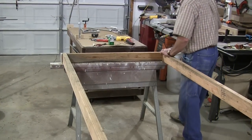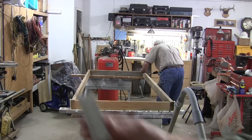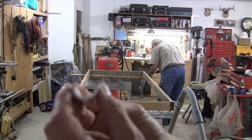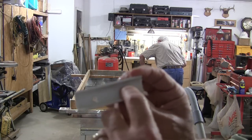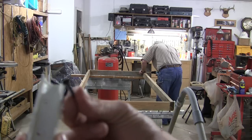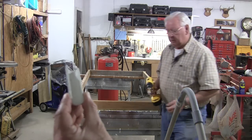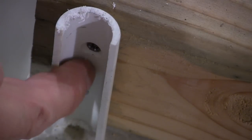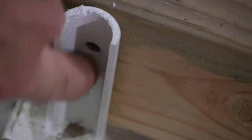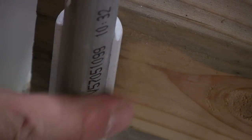So now we're going to see just how difficult it is to put one of these together by doing a little test bed here. We're going to set it up on the ends, do one in the middle, and then put the sheeting on. I recommend that when you rip this down to create your grabbing stock, countersink some holes in there for your wood screws. That way your screw head goes in nice and flush — you don't want it sticking out and pushing on your PVC. So make sure you do the countersinking. The pipe itself is going to be nice and flush and fit in there nice and snug.